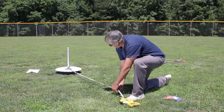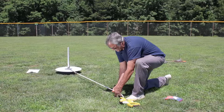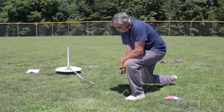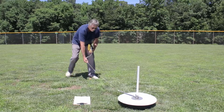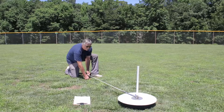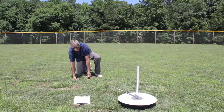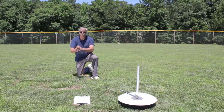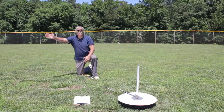So now I'm going to ensure that I'm on 270 degrees, and I'm right there, and the distance is 5 foot 8.5. I'm going to put this nail right dead center on that, and then I'm going to go the exact same difference at 90 degrees. And set this thing up same as we did before. I am going to go halfway between there, and I am right there, and 5 foot 8.5, and that's where we have the pin. And so from here on out, we'll just do the same thing every 10 feet, but we'll use the new dimension, which is going to get wider and wider until it gets near the middle, and then it's going to start tapering in. But the process is the same all the way down.